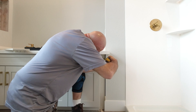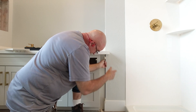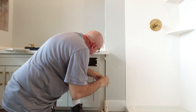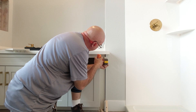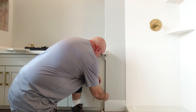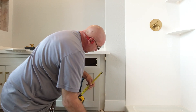So I'm going to come up to the top, find one inch, and take a second shim — or even two, because the wall's not very straight. Welcome to Arizona. So that holds everything in place. Now we're at one inch and we're actually a little shy here, so we'll have to tighten that up. And snug it up — still at one inch. We have one inch on the bottom, one inch on the top.